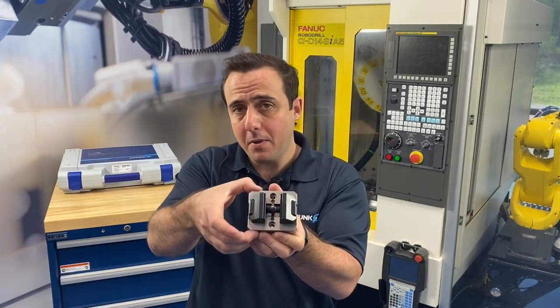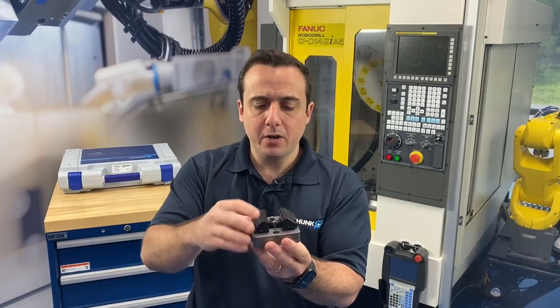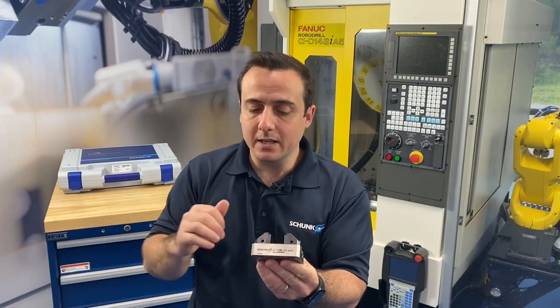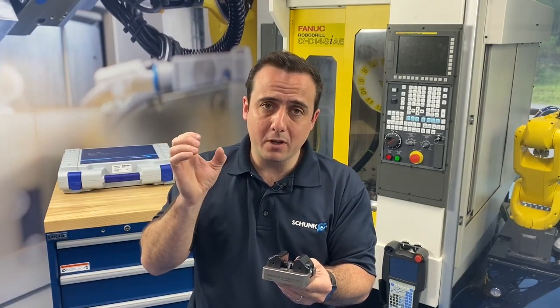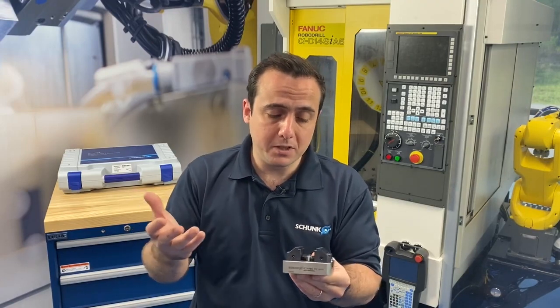So you have a compact profile, a low height, and in that small compact profile we really pack a punch with the clamping force. We have a very efficient spindle design with very tight tolerance fits between the shaft and the bore that the spindle sits in, and what that means is that at a given input torque you're creating very high clamp forces. If you need to have really good part access, you need to make sure you're clamping on that part securely. With this vice, because you're biting into the material so well with such an aggressive grip geometry and high forces, it means you don't need to prep the workpiece because the simple clamp is enough to give you a really strong hold.